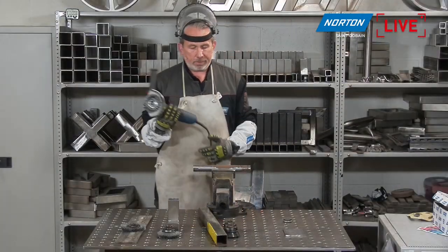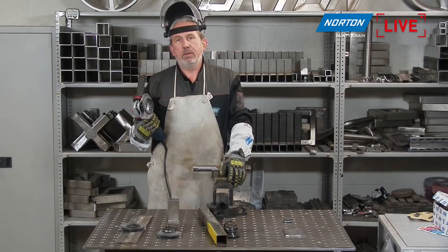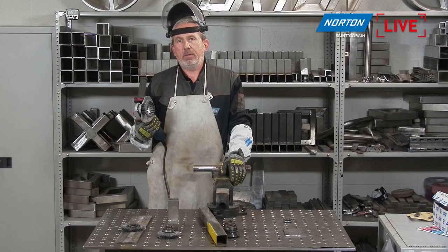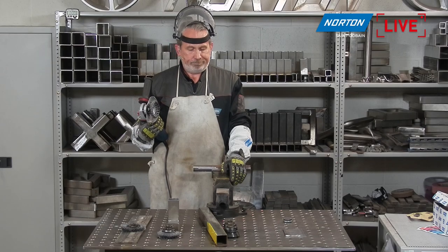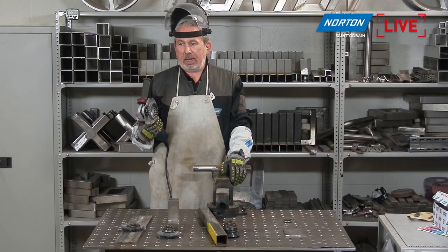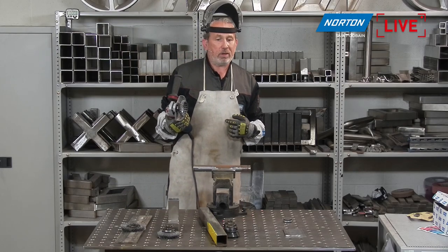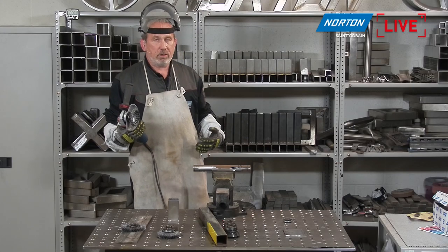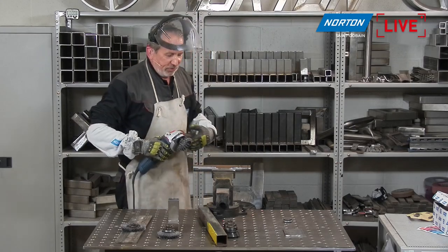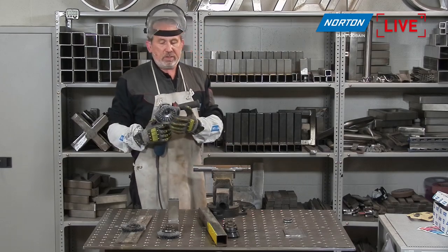Yeah. You're right. And also the quality of the steel. This is a very high quality tempered steel. They are steel that are not really tempered, and they are low quality steel that, of course, they still open and go through and go away. It makes it break more often as well, and that's for me as an operator I don't want, because that means that broken wire is going to go somewhere, mainly in me. So quality is important.